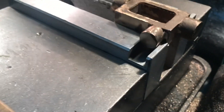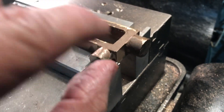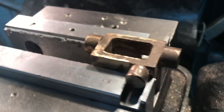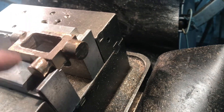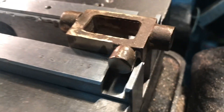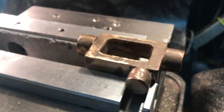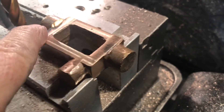Tonight I'm just trying to get the outside edges of the steam chest machined down to a half inch thick. I did one side already and I just wanted to show the setup. These soft jaws are really excellent for stuff like this — having this slot in here, you can see I can get full support on the whole outline, and there's a little place for the boss. This is leftover from my Allen Mogul project. They're aluminum soft jaws and they really help. Alright, this side is complete.